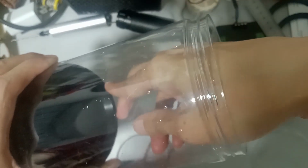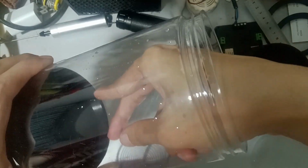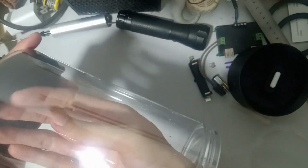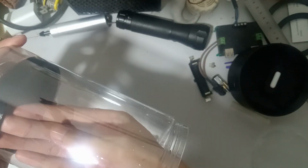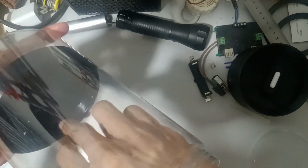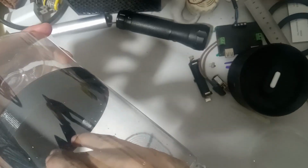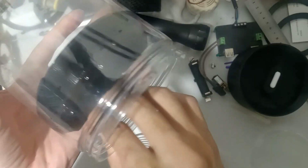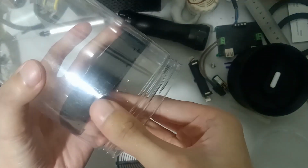When the final piece of the ring has been put together, slowly push the whole 3D printed parts parallel to the shape of the jar slowly. You will need multiple tries on this one. Once they are all inside, you will want them to be at the lip. To do so, you slowly pull the ring, but be very careful as the pieces could crumble and you have to start over from the previous steps again.